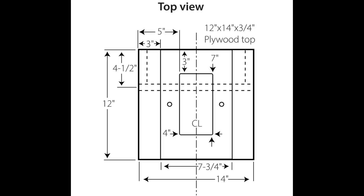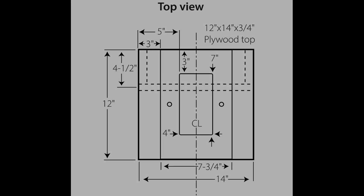This is where I think StewMac made a mistake. Looking at the top view, you'll notice that the two sides are 3 inches wide, but the slot is routed out to 7 and 3/4 inches wide. Adding that up means the top would come out to 13 and 3/4 inches wide, not 14 inches. So the sides should be 3 and 1/8 inches. The templates themselves are 7 and 3/4 inches wide and have to fit well within the routed-out slot, so take care there when making this jig.